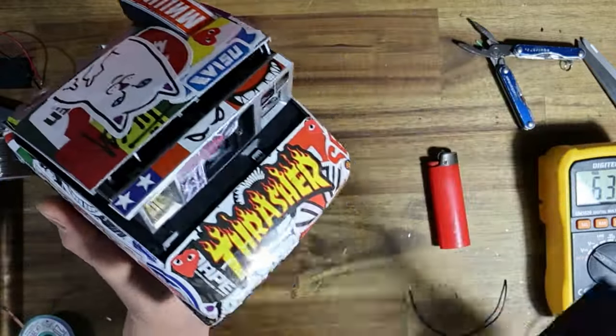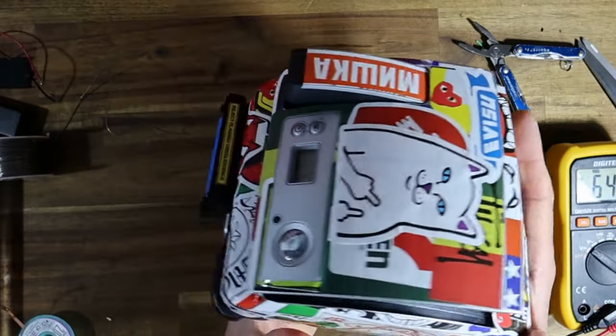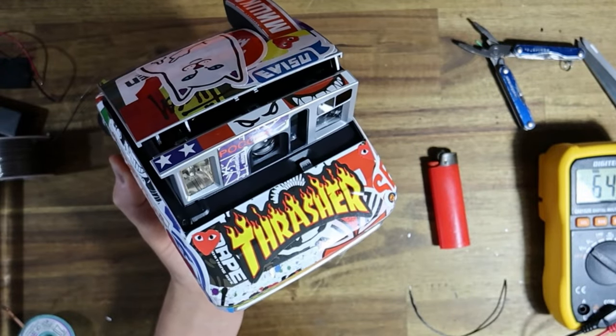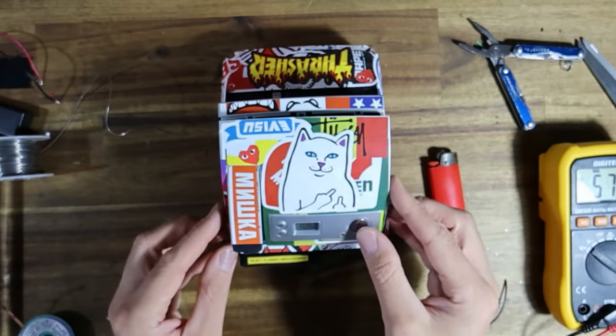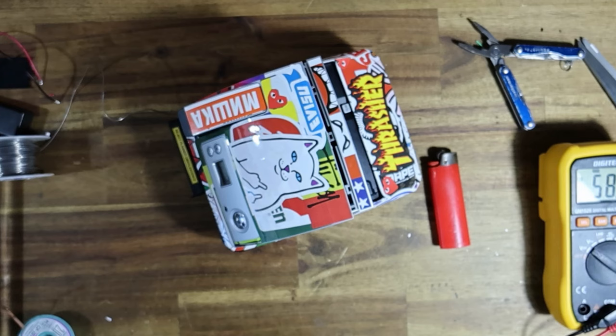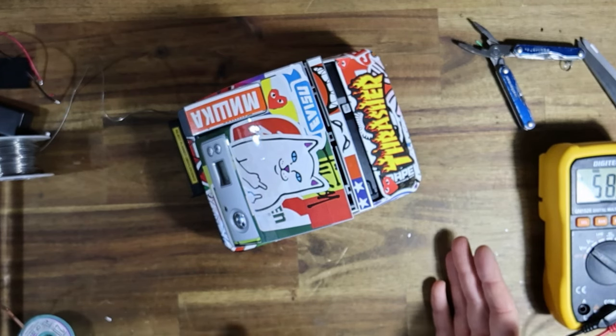So if you want it to eject the dark slide like normal, you have to insert the pack of film, then turn it on, then close the door. Which is a really weird quirk, but that's just the way these cameras were designed. They're not designed to receive power without there being a pack of film in there.